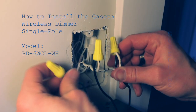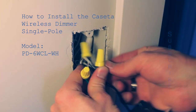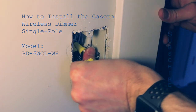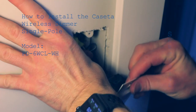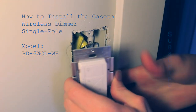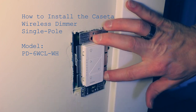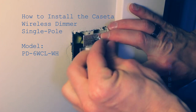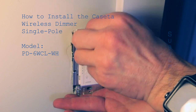Put all the wires back into the wall box — just shove them in as far as you can. The dimmer switch is a little bigger than other switches so you may have to push it in a bit farther. Then take the screws and screw them back in just like the others. Remember, these screws go in the bigger holes on the switch.